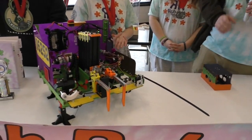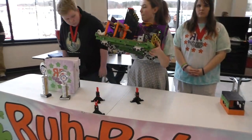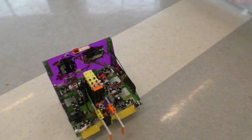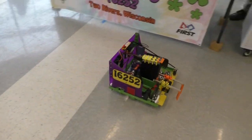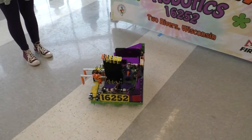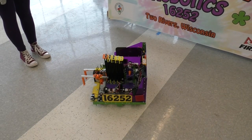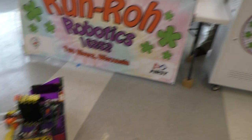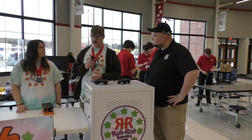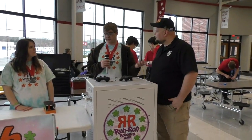It works in tandem with our drive base. We actually went with a slide drive, something you'd see in FRC — we have side-to-side motors, so we have forward and side-to-side motion as if it were a normal tank, and then we can also do full diagonal motions, kind of similar to how mecanum drive works, and then we can turn from that. Why did you go this route instead of mecanum? Having FRC experience, I saw the benefit of slide drive — being able to turn on a point, being genuinely faster and easier to position and maneuver during the match. It also allows us to maneuver around alliance partners more easily and has more resistance than typical mecanum drive.